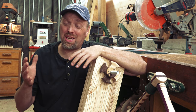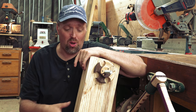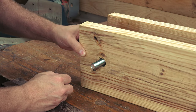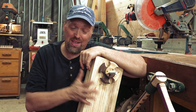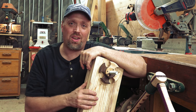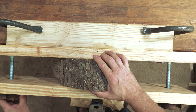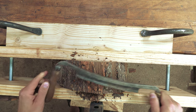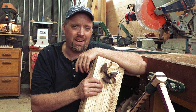Let's talk about the additional advantages this vise has over the single screw vise. With true double screw vises, the holes in the front jaw are actually wider than those in the back, giving you the ability to purposely rack this vise — and with this vise, racking is a good thing. Stock is not always going to be dimensionally square. You might have a tapered leg or be removing bark off a cookie. The double screw vise is a beast that will clamp odd shapes without batting an eye.